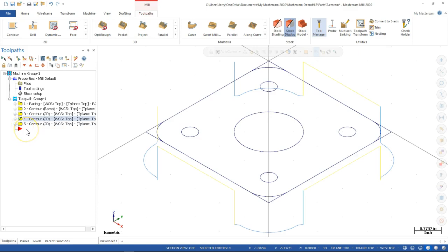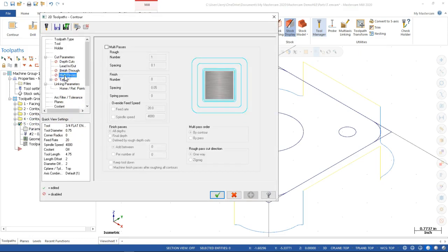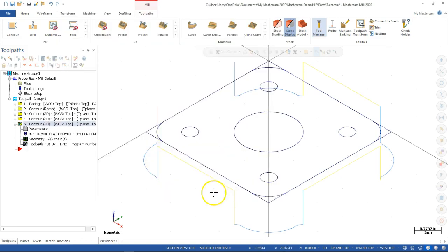The other thing, if I wanted to stay with the contour, if we did the ramp entry and then did the sidewall, now I can't think of it. Go back and double check here. The multi-passes, then there's still a possibility I could get it to do the same thing. But until you try these operations, you experiment with what works and what doesn't work for your machine. All I'm really trying to do is give you combinations that will achieve a desired result.